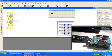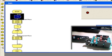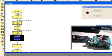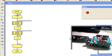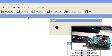Now we're going to put that in a loop, which is typically what you do with an embedded project — you want your code to run from beginning to end and start over again. Let's drag a loop in; that's easy to do in Flow Code. Drop it right there and drag the components into our loop. Now when it ends, it jumps back into the while loop and just keeps going forever until power is removed or an external reset via master clear. Let's check the simulation — off, on, off — all right, the simulation is working.